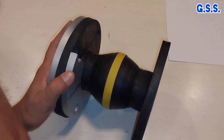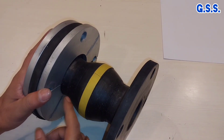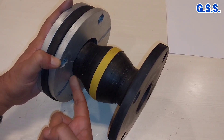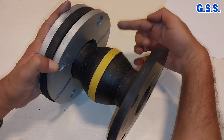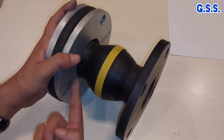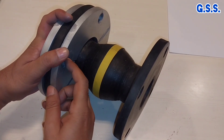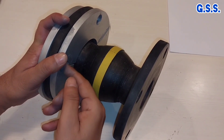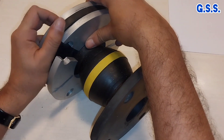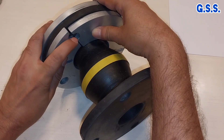Now this is one piece of split retainer ring, and this is another piece of split retainer ring. These two retainer rings are split at the bolt hole location. If we split at another location, when we make it bolted tight, then rubber may come out in the split area. When we split the retainer ring at the bolt hole location, due to compression rubber will come inside the hole area and rubber will not come out. For this reason the splitting of retainer ring is made at bolt hole location.